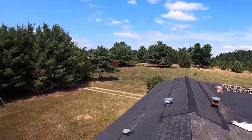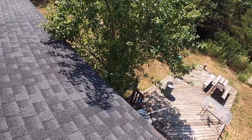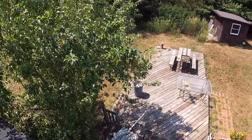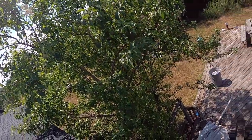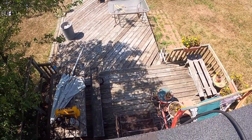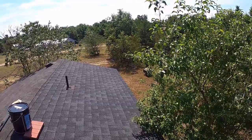Let me grab the roofing. So where you wanna, the compressor's right there. Just pull, where you wanna spread tar. It's along the edge here. And there's already nails in there. So spread tar on the edge of this and along the edge.